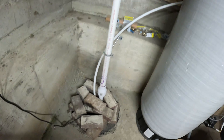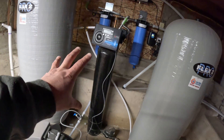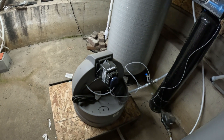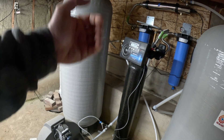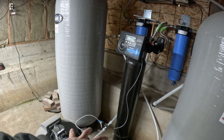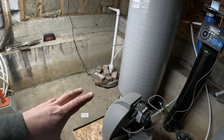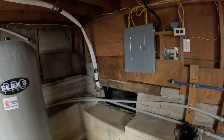The dirty water dumps down into the hole where the sump is. It does that about every thousand gallons. To keep this unit lasting longer, we've got a chlorine unit that chlorinates the water inside the filter when it's cut off from the household during its regen cycle. It washes out the filtration unit, flushes that water — along with the bleach — into the sump, and then fills back up with fresh water from our holding tank.